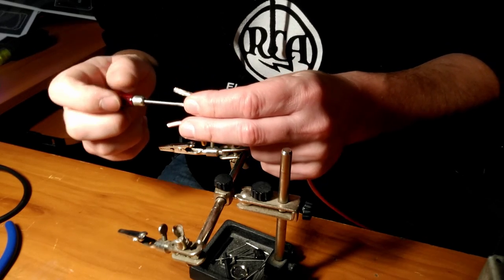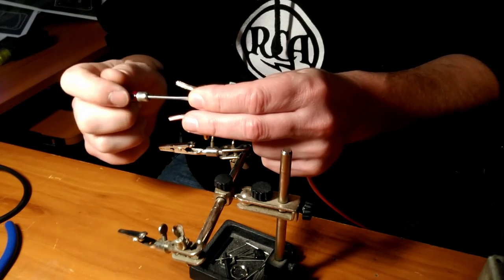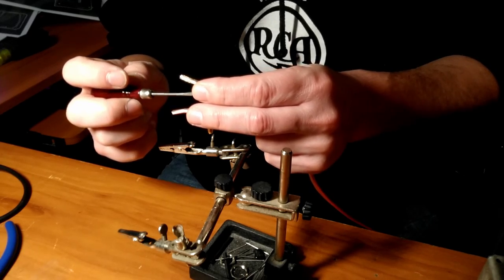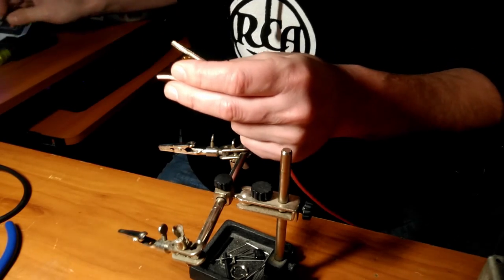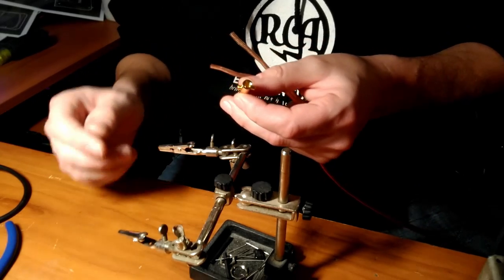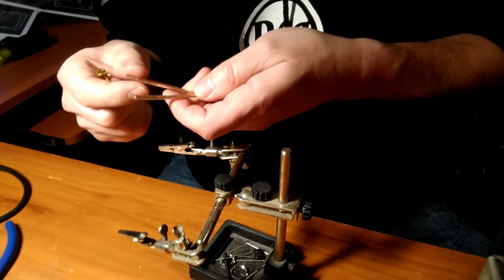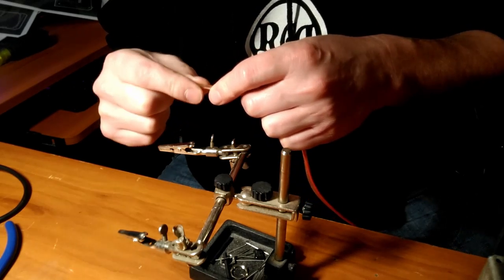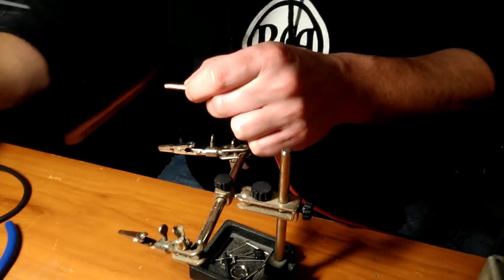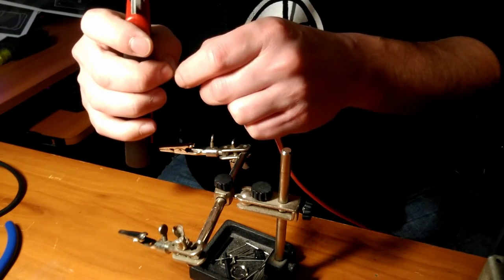Wattage rating on a speaker means how much power it can handle without blowing up or failing. And so our amplifier, as we said, is about 7 watts per channel. So ideally, when you're choosing power handling on your speakers, you want it to be about double the expected output of your amplifier. So about 15 watts would have been perfect, or even 20 would be a good match for this amplifier.